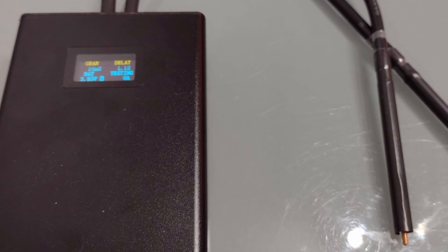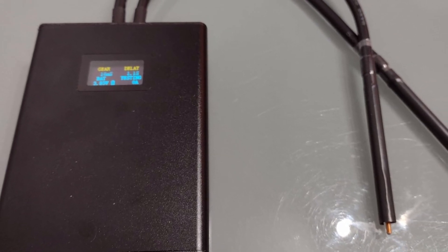On some forums I've seen people suggest cold solder — I've never used it but I don't see why it wouldn't work. For myself I've chosen to buy a mini spot welder, partly because I have a fair few devices where batteries would benefit from being replaced. The spot welder itself is a bit fiddly to use but actually very effective. I'll put a link below. So let's crack on and do a bit of spot welding.